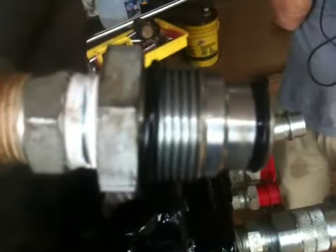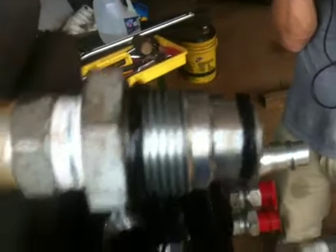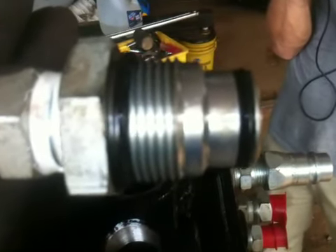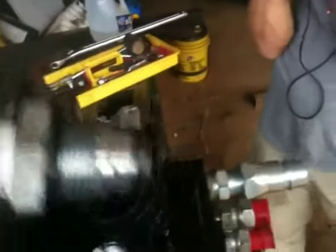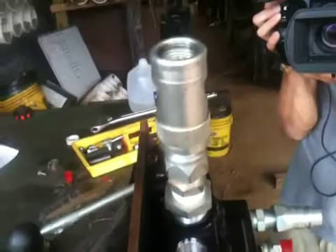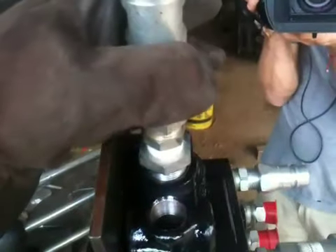What I shall do, therefore, is do the first hydraulic hack: cut off the bottom part below the threads with the O-ring, so it does not block the return line from going out the power beyond. That should make this valve work while retaining the power beyond outlet as the connection of choice. Let's see if it works.